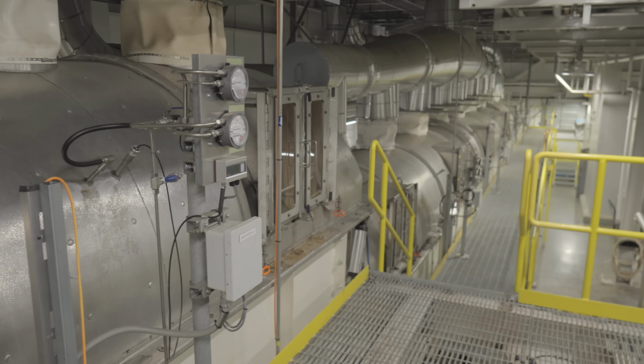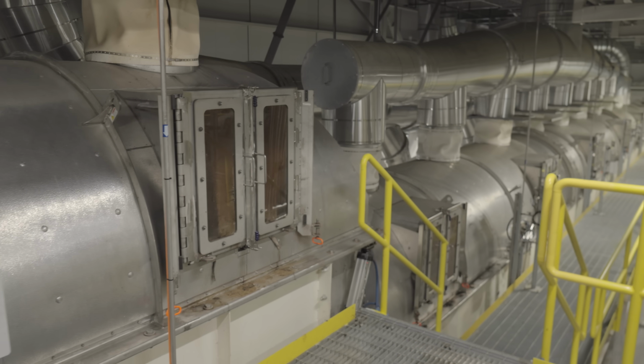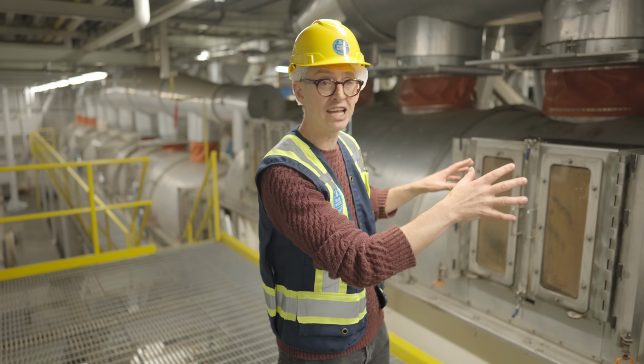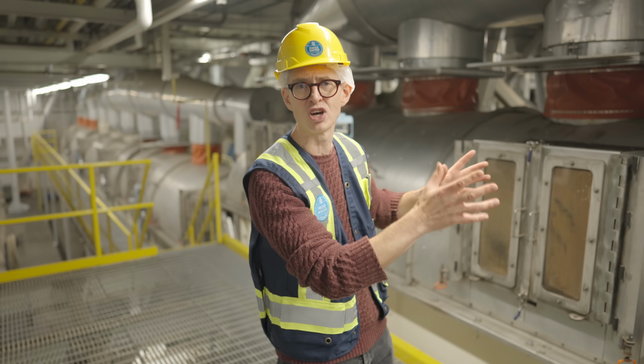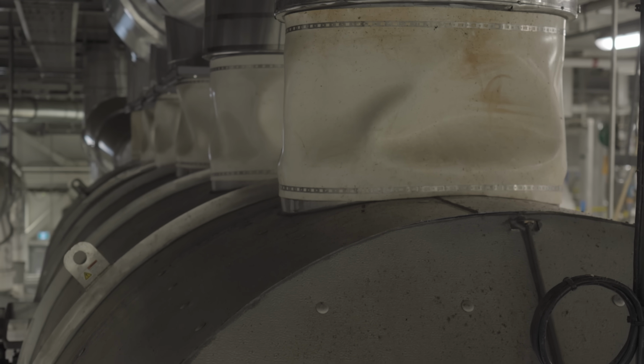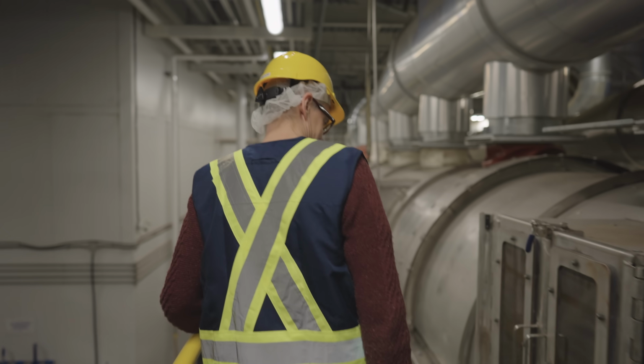So after decaffeination, we have to dry the coffee. It'll enter here into this continuous dryer. The whole thing's vibrating to move the coffee through the system. It has 3 stages. The first one next to me flushes off most of the moisture. The second stage brings that moisture down to 10.5%. That final stage will cool it down.